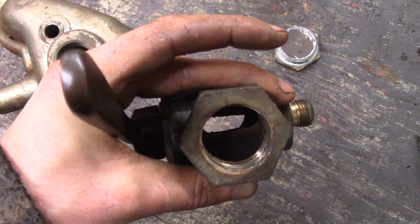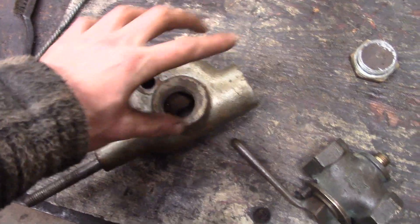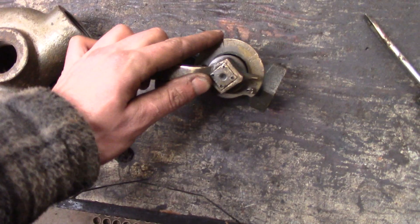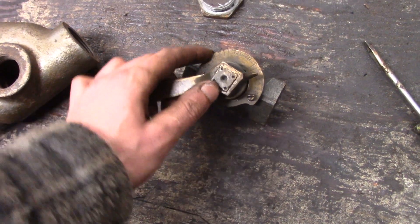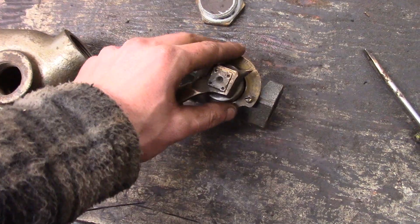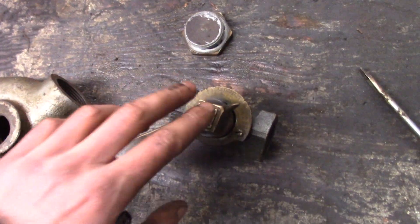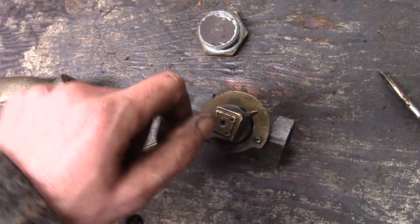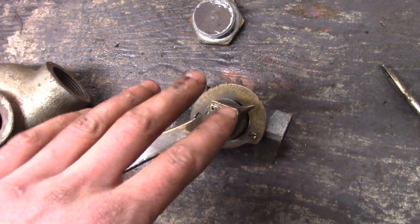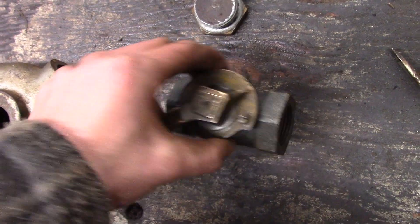But in this case it doesn't really matter, because this governor valve does most of the metering. You can do coarse metering with the inlet valve just fine when you're kind of weaning the engine into fuel for starting purposes. But once the engine's running, you can pretty much just keep that open, or at least most of the way open, and allow the governor valve to do most of the work. If you're running an older oil field engine like my Patton brothers, where you really need to finely control the gas supply and this diamond valve is your one and only throttle, you probably want a real diamond valve.